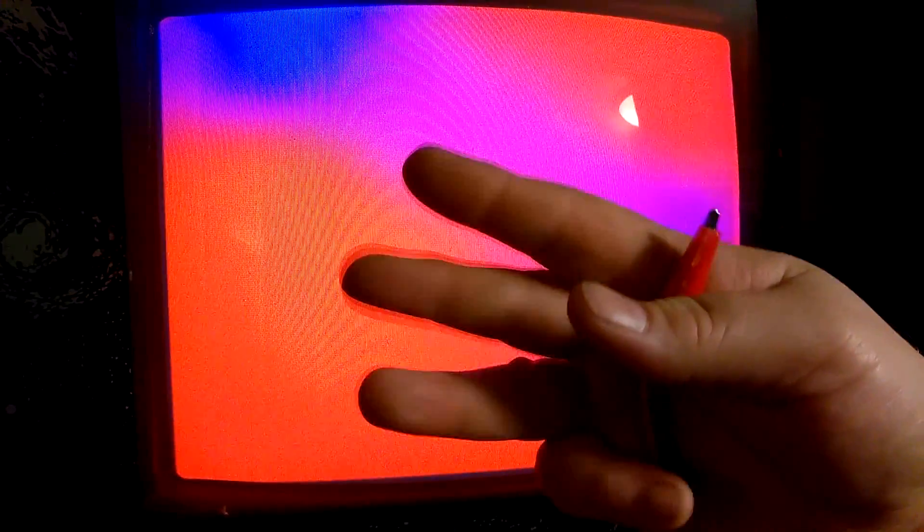Let me tell you guys a trick. Right here I have a plain old jumper. It's easiest to degauss your monitor when you have a solid color on your screen. This is a Stargate, and it just happens to have a setting where I can make a solid color. But if your game does not have any settings, what you can do is ground this somewhere in your chassis. There should be three transistors on your neck board. If you connect this to the top of one of those transistors, your screen will be solid red, solid green, or solid blue, depending on which transistor you grabbed. So it's easier to tell what's going on.